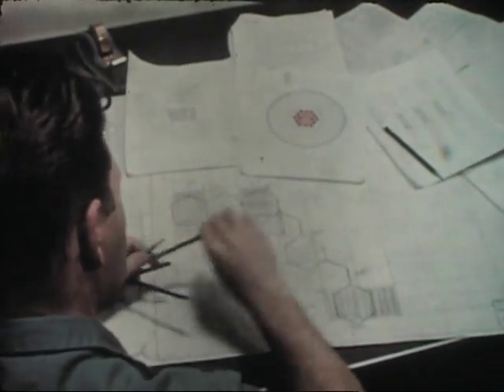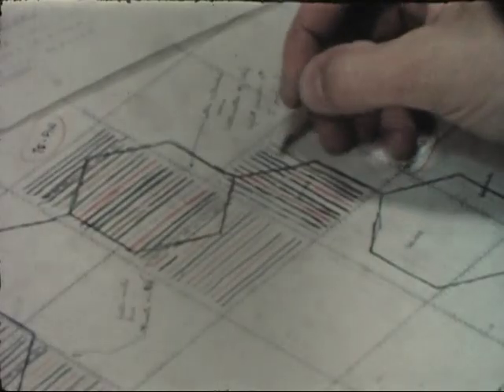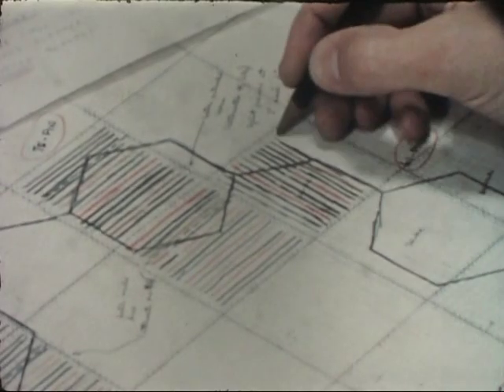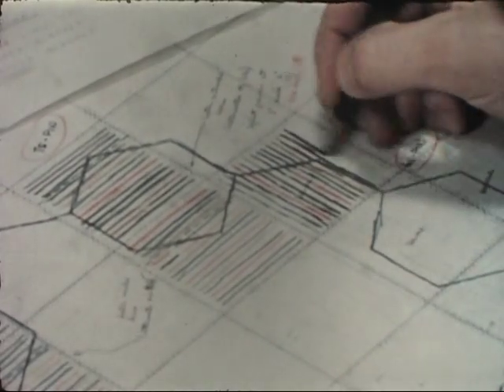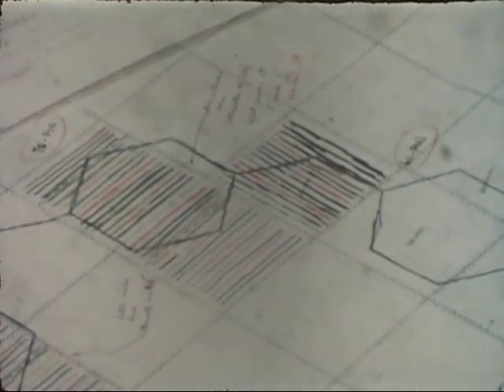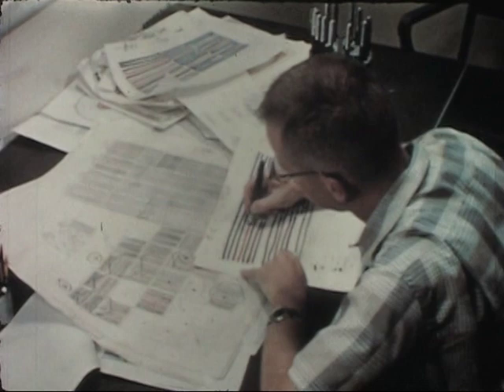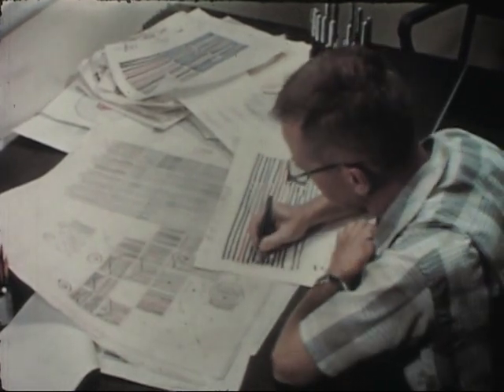The core contains 14 modified fuel sub-assemblies, which are utilized as control and safety rods. These dimensions are then translated into a loading configuration for full-scale mock-up in the critical facility. Core, control rod, and blanket regions are laid out in composition and dimensional details within drawers and fractions of drawers. These plans are then applied to the individual drawer loading diagrams, and after final approval of the loading pattern, these diagrams are utilized as a guide in the loading of each drawer.